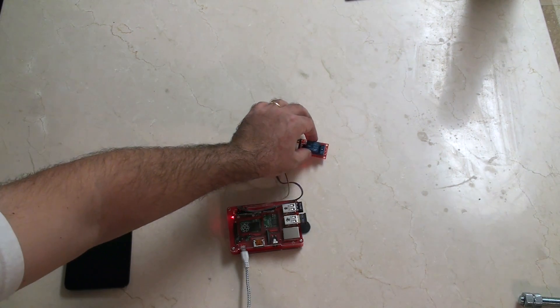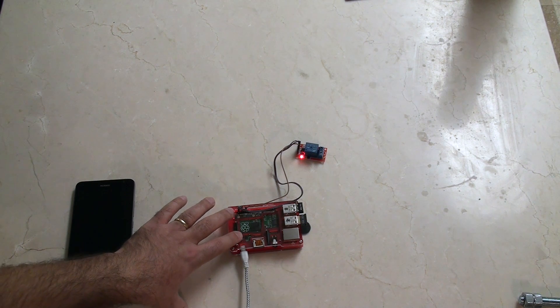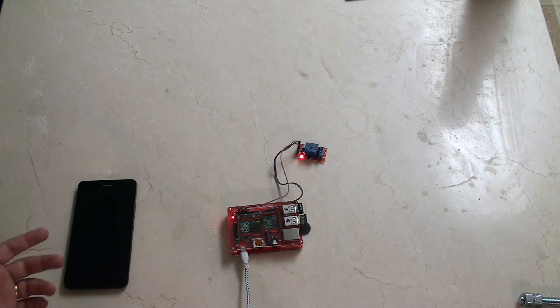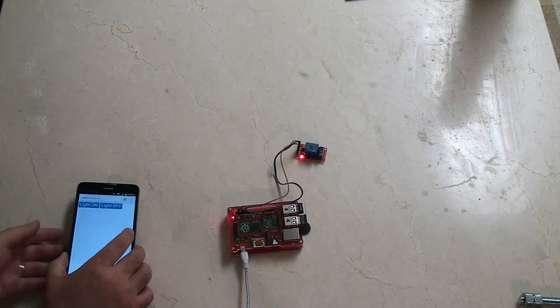Let's talk about this relay. This is a one channel relay and if you've watched any of my how-to-set-up-a-relay videos, you can find those links on screen now. What I've done is I've taken the basis of another project — my garage door relay — and set that up here as the basis of this project. I've set up an Apache server on the Raspberry Pi model B+, and I can access that Apache server via my phone. I've created a PHP document that has just two functions: light on and light off.